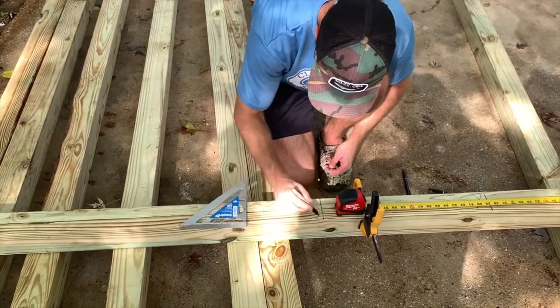So here I am continuing down the last row. Again, I'm installing a copious amount of this asphaltic coating, which I'm kind of using as an adhesive. And then I'm taking a full row of shingles. I'm installing it in place so that the bottom of that shingle row is still flush with the top of the wide cutout of the shingles below. And then I'm going back and I'm covering all the nail heads with that asphaltic coating.